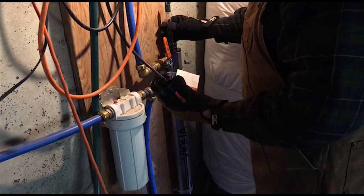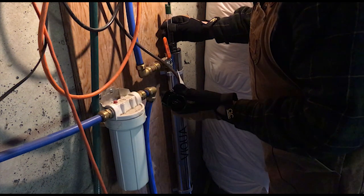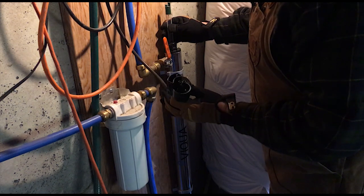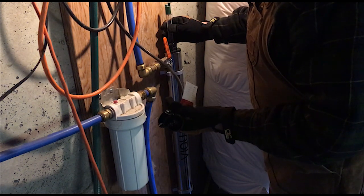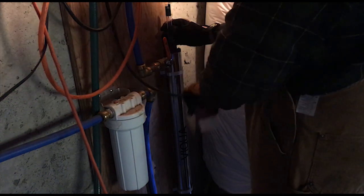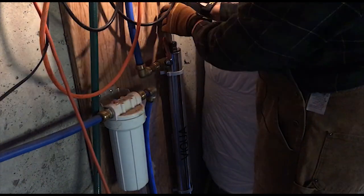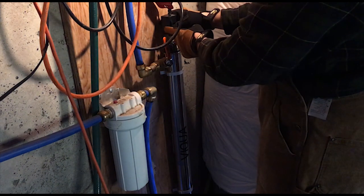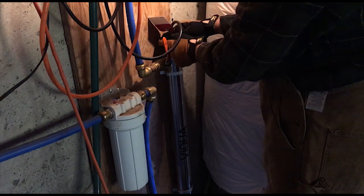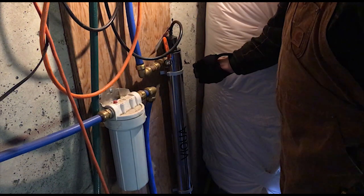I found it's easier to keep the glass bulb out while you put the cap on, because you've got to match up these little plugs to the bulb — they're at different heights. The smallest one on the plug cap goes on the tallest one on the bulb. Once you've got that seated, just lower down slowly, clip it in, and you'll hear it click. And we're ready to go.